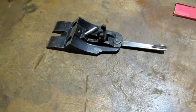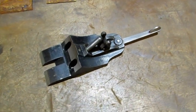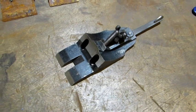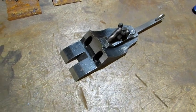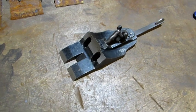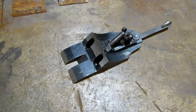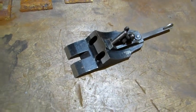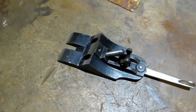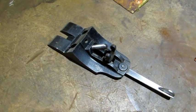Most of the time the Japanning on the frogs is better than what it is on the bottom or the base. If it wasn't, I would have stripped it with some stripper before we did all this scrubbing on it right after the wash. When I washed it down with the Simple Green, assess the Japanning. If you don't like it, strip it off and then do the same scrubbing that we just did to prep it for paint. If you've got a sandblaster, I put it in the sandblaster after the scrubbing.